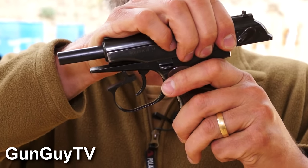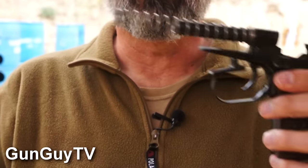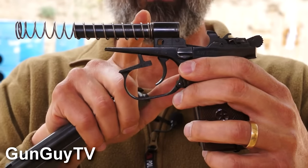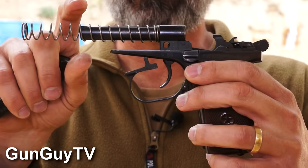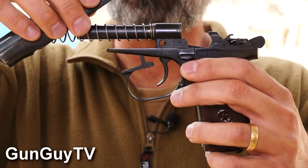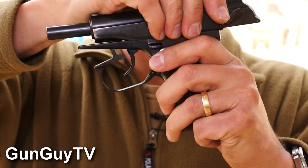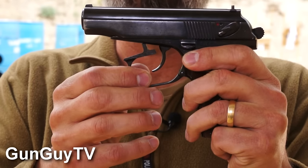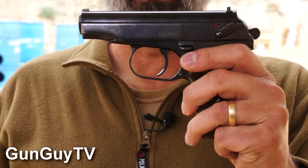Then you pull back on the slide, lift up, and separate the pistol from the slide. So you have the slide here and the pistol there. You'll notice on the pistol that the barrel is still attached to the pistol and the spring comes off the front of the barrel. So the barrel on this gun serves two purposes: it's the barrel fixed to the frame and cannot be removed, and it's also the guide rod for the return spring. To put the gun back together, simply take the slide and fit the spring and barrel back in the front of the slide. Push the slide all the way to the rear, wiggle it a little bit to get it in position, pull down on the trigger guard, line it back up, and let it fall back into position. Now the gun is ready to shoot — how simple is that?